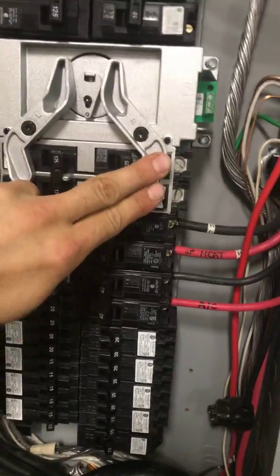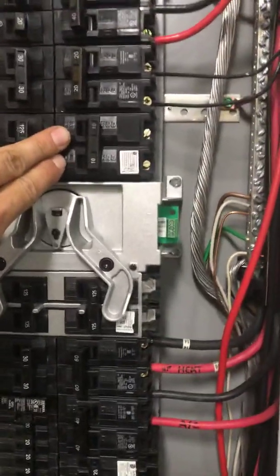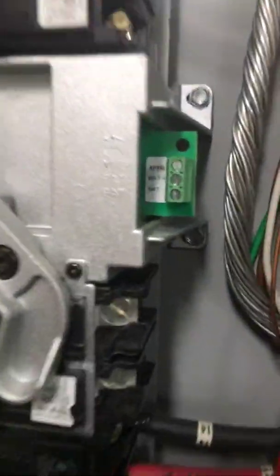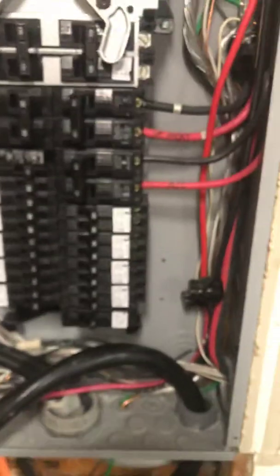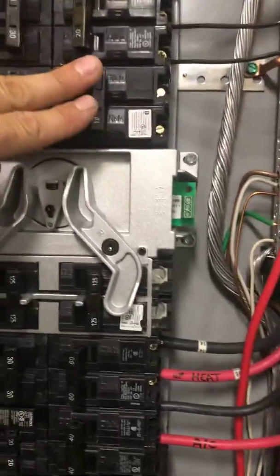The two hots will go here, and then your low voltage. This breaker here is your sensing breaker — in one and in two, which is yellow and yellow-and-black in this cable. What that does is tell the generator when to come on. When it loses 240 volts, it activates the generator, which sends a signal back to this point transfer — that will be your white wire. Battery positive is red, battery negative is black, and then the blue wire out of the cable goes to a battery charger.